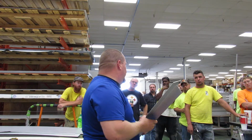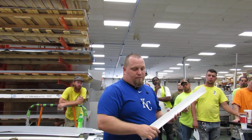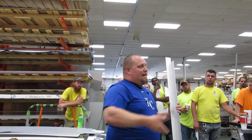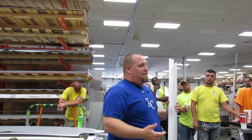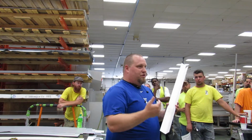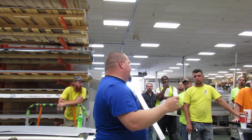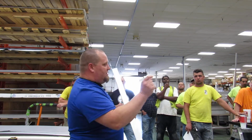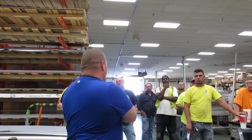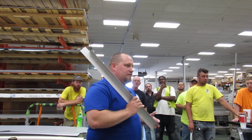It's never going to hold. It's a weak spot right there that comes right into the corner. Some of the waterproofing we're doing inside those corners will help keep water out of the building, but it still is going to be a failure spot on our caulking. Those inside corners need to be cut, turn back those tabs so the backer rod can go back there and you have a clean caulk joint that runs at the same location as the pressure plate all the way back and around. So you have a continuous line and you're not just caulking to the edge of this.